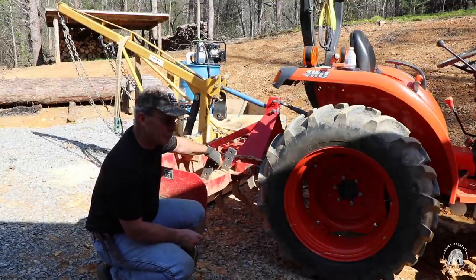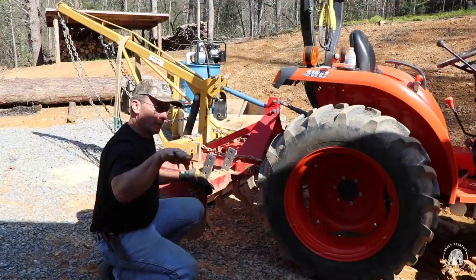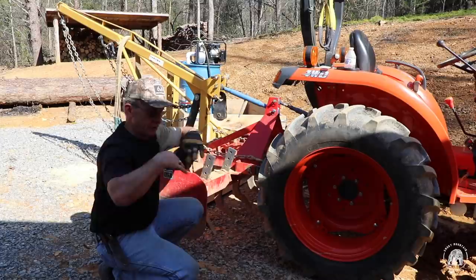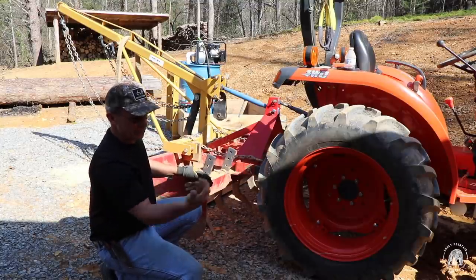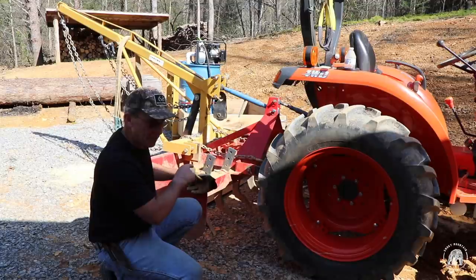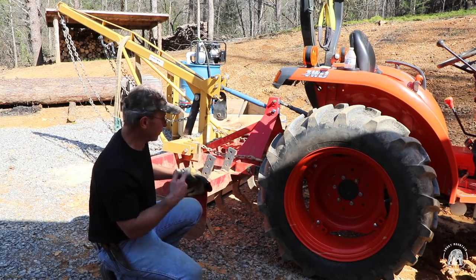Okay, what I've decided to do before I drop these rippers, what I may try doing is I've got it tilted or leaning in that direction because I want the dirt actually to slope back towards the bank. So that creates a ditch, because it's higher here than it is on that end, so it's naturally going to flow that way. But since I don't have the ditch, it's coming this way. Anyway, I'm going to get back here and see if I can go ahead and set this down and have the blade actually knock it down and pull it out that way before I have to reset all of these, because these will really dig if you set them down. So I'm going to try that first.